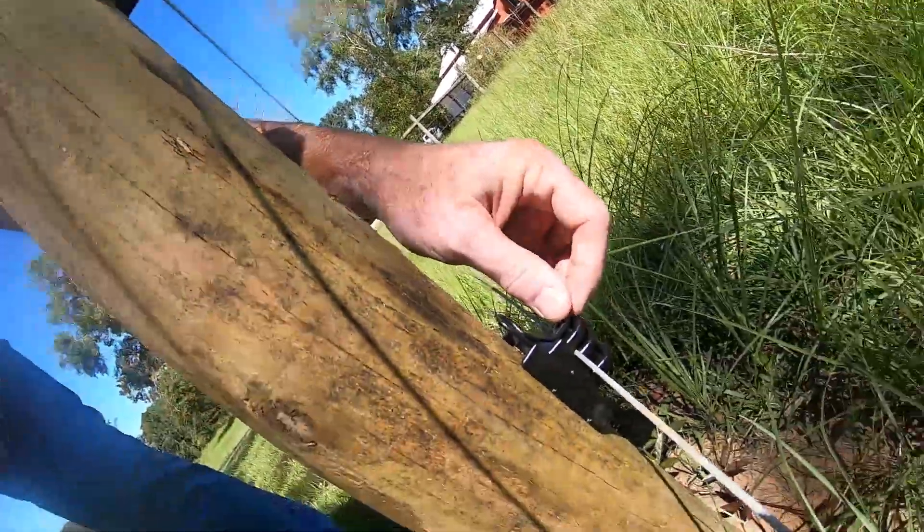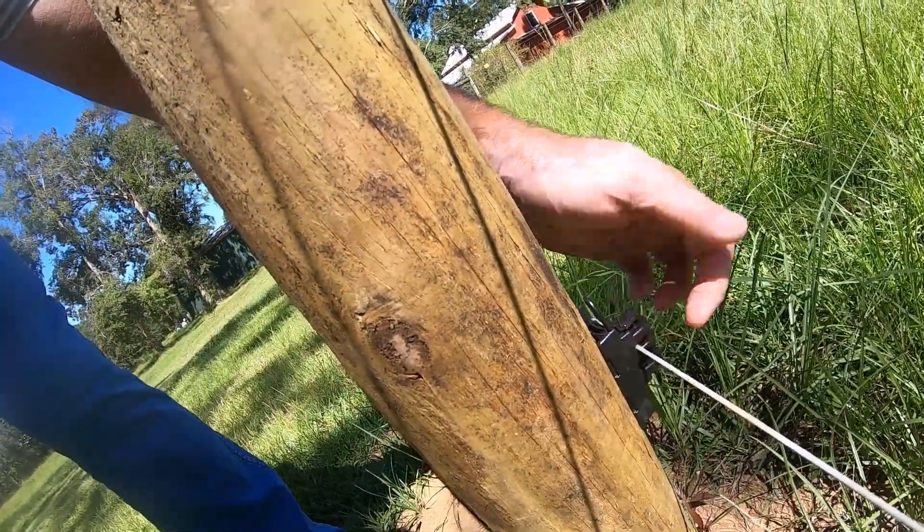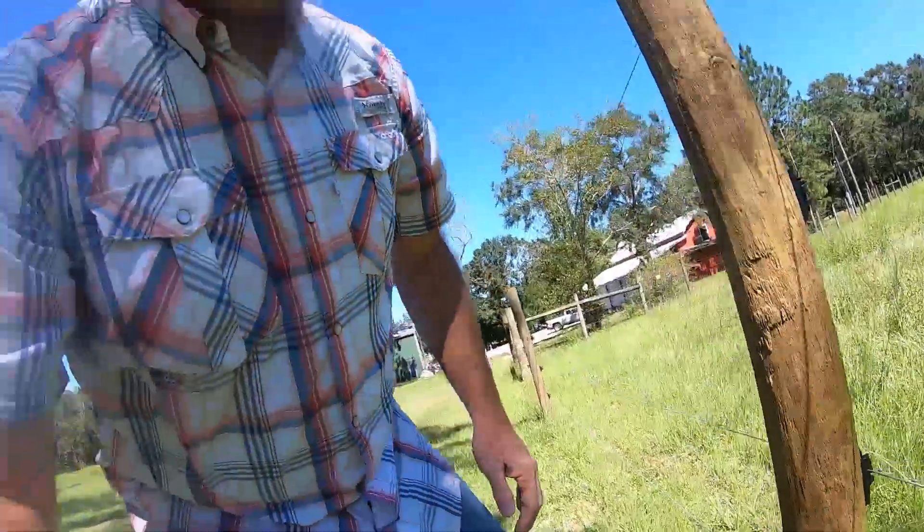So what I'm going to do is replace that with a poly rope. And I understand — yes, before you comment — the braid is better, but I don't need 1,300 pounds of breaking strength. I want a lower breaking strength. If a horse gets a leg hung on the bottom strand, the fence will give. These little pins pop in and out, the wire will break through them. I'd rather the fence break loose and let the horse get out than have something that's going to hold his leg hard and fast. I'm putting grown horses in here — not trying to keep goats, pigs, or anything small.